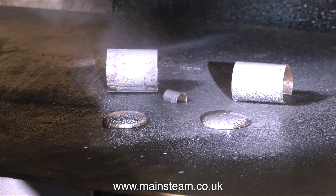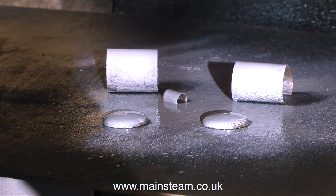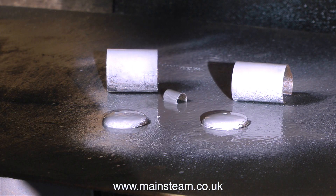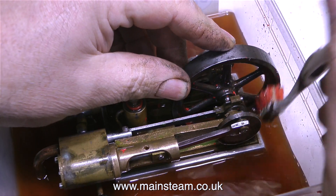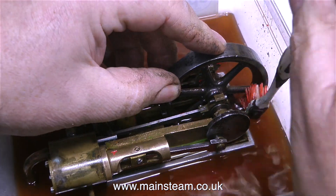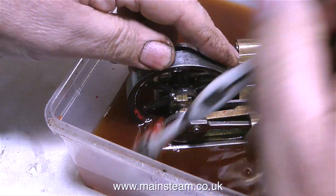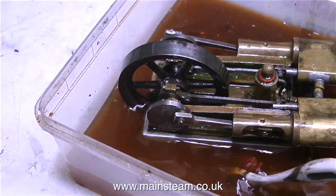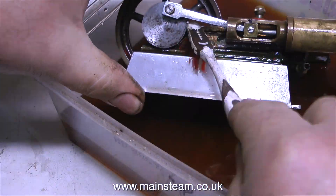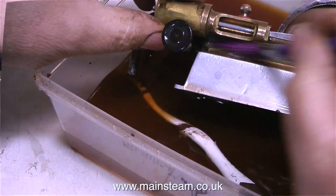Now that the cylinder covers and the cylinder end caps are all cleaned up, including this small junction that goes over the piping between the cylinders, it's time to spray them. This is Phoenix Paints etch primer — it's always a bit weird to spray with but once it's on there it doesn't run and it looks fine. Now the engine's back in the new cellulose thinners and I'm removing the paint from the flywheel. This engine's not going to clean up brilliantly because it's been stored for quite a few years in a very un-steam-engine-friendly place, but it runs beautifully. I'm scraping off some paint from the body of the engine and as you can clearly see, this engine used to be green.